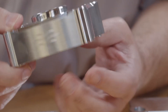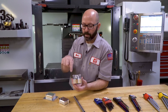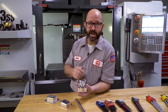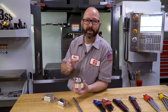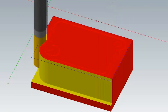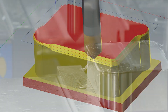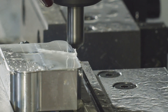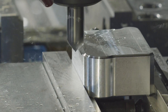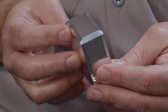One of the key features is this cool swarf cut around the outside edge — it looks like a five-axis cut, like a 3D surface, like the tool was going up and down around those corners. That's not the case. My dirty secret is I just give my chamfers their own unique contour, a cutter path different from the contour used to create the outer surfaces. In the CAD file, you can see the end mill walks around the outside of the part, and the chamfer tool walks a different profile I've created. The chamfer tool is not moving up or down in Z at all — it simply walks around the outside, cutting deeper in XY in some spots because I've given it its own profile in the CAM system. That's my secret for making cool, sexy-looking demo parts — it's actually pretty basic and simple.